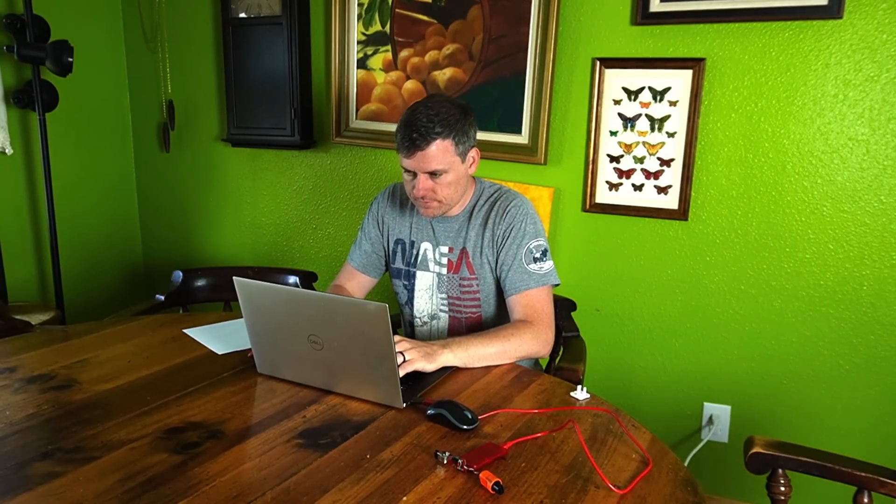It's not pretty, but I got it all soldered together. Let's test the connections, make sure there aren't any shorts, and verify the voltage regulator is working. I think I'm ready to actually start coding up the USB part of this. I spent way too long trying to get the USB half to work. I started by getting the control transfers working — a control transfer is just a way to configure the USB device that's plugged in. That took some time, but the good news is the other transfers are easier than control transfers.